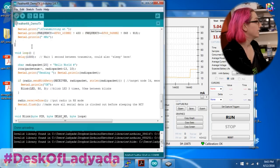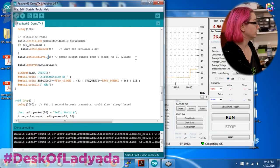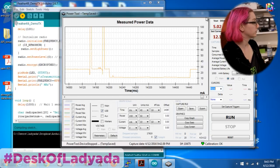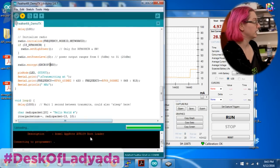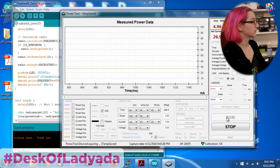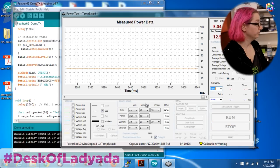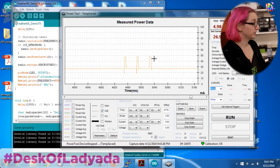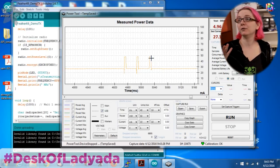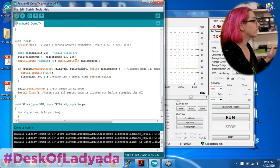You can reduce your power level. So instead of 20 dBm, let's try zero, which will give me 5 dBm. And what's nice is because I have the USB power monitor in pass-through mode, I can program it while also measuring the current. So it's programmed. Now you can see when it transmits data it's only taking about 45 milliamps. So if you don't need to be that far from your device, pick the lowest power level. That's one way to save power.